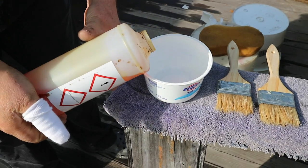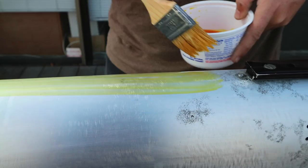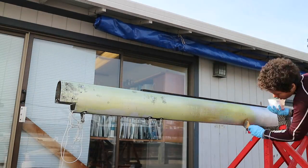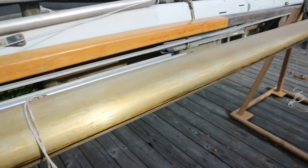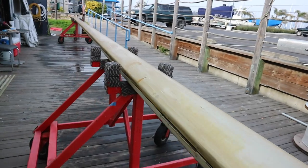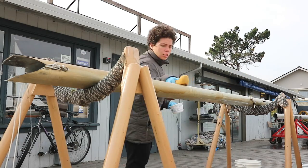It's surprisingly difficult to get paint to stick to a material such as aluminum, so we used both the Alumiprep and the Alodine to ensure that the paint would stick properly and to help prevent corrosion in the future. I really liked the golden hue of the Alodine, but alas, it wasn't permanent.